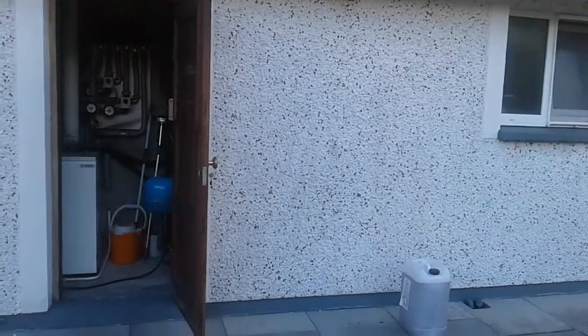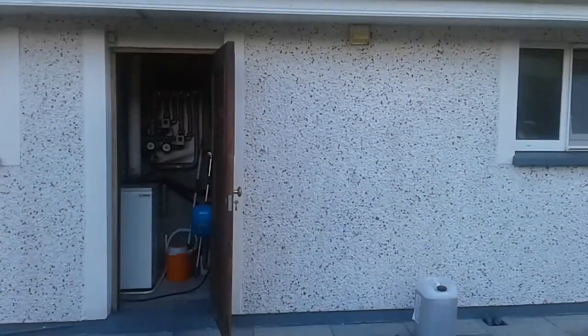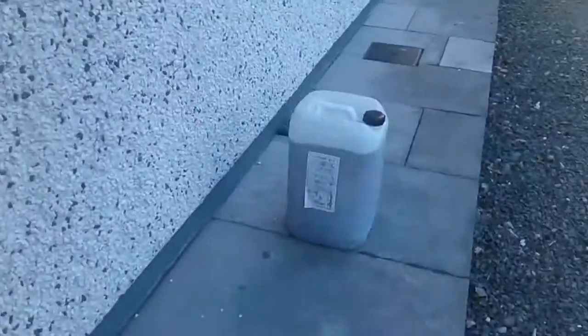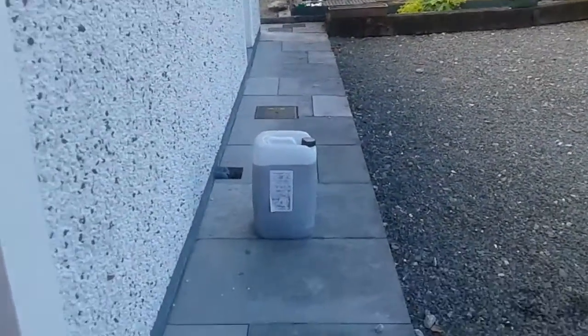Charles Mass in Cork, near Mellow, assessment for heat pump retrofit. We have an ideal place on this back wall for a heat pump. There's a slight slope on the path so it just needs to be shimmed, and the front of it would be sticking out to the front of that drum.